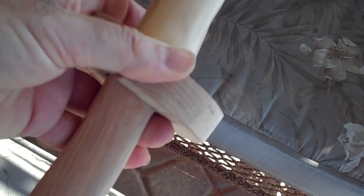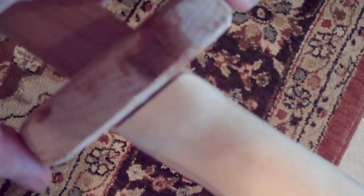Before gluing, I'm going to shape the outside of the hand guard a bit and get it looking the way I want, because once it's mounted it'll be hard to shape. I epoxied the two ends together on each sword, and while the epoxy dried I carefully moved the guard back and forth on the sword a little so it doesn't get glued into place yet. I used two-part epoxy because I didn't want to wait too long. When it comes to gluing it to the actual sword itself, I'll probably use wood glue and wait the full 24 hours to cure. Then I can sand it, shape it, push it into place, let it sit 24 hours, and do the final sanding.